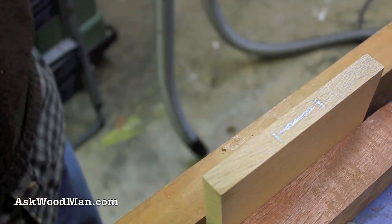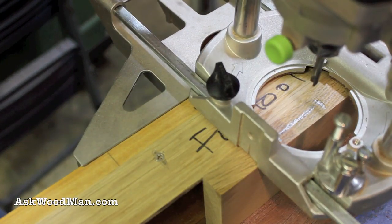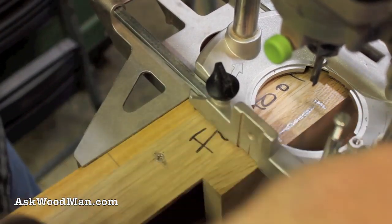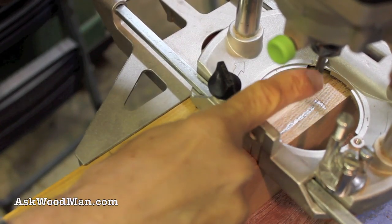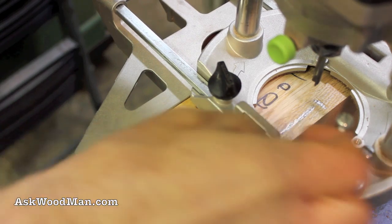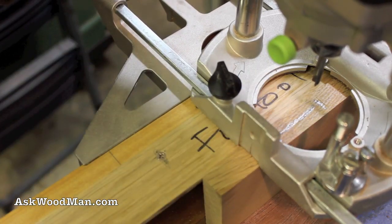I'm putting my plugs in and safety glasses on. I've also disconnected the vacuum hose so you can see a little bit more of the plunging action - that cowl kind of limits visibility. It's going to be a little dustier but I hope you'll be able to see what I'm going for. This is a straight bit, not a spiral fluted bit - just a straight quarter inch bit. We're going to be cutting a pretty narrow mortise, slightly more than a quarter of an inch, cutting on one side then flipping the stock around to cut the other side to make the mortise symmetric in the middle of the board.